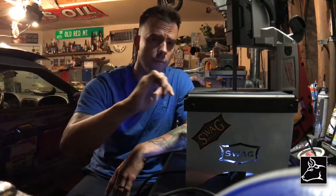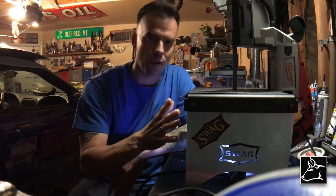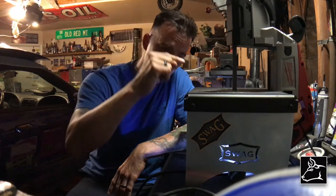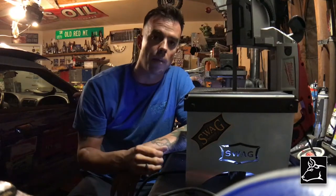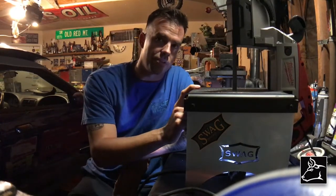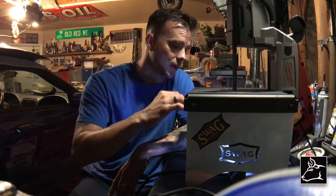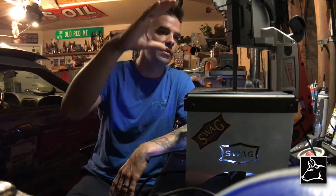I really, really like this and I am not paid to say that. SwagOffRoad.com — this is version 4, but when you go there read the notes: the versions don't mean version 4 is better than 3, 2, or 1 — it actually means what saw in particular it's going to fit. I've got about $500 wrapped up in this whole setup. You can recreate this for substantially less money though — you can buy a used Milwaukee or a Harbor Freight one, buyer beware. They have port-a-band stands to fit almost any make or model bandsaw, and there's even a flat-top version that mounts into a bench vise for about 50 bucks. Made in America, assembles with basic hand tools, very easy to put together. I can take the saw in or out without any tools — the capability of a vertical bandsaw at a fraction of the price and a fraction of the real estate.